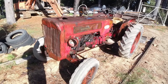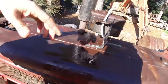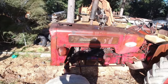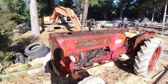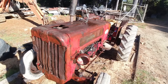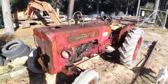Well, it works. It runs on vegetable oil, no problems. It's just about empty. So I was running for about an hour on pure vegetable oil. It actually smells a lot better running on the veg oil, because it just smells like hot cooking oil rather than diesel. So yeah, it's much nicer to operate not having to breathe diesel fumes. It did have a little bit less power on the pure vegetable oil, and it was smoking a little bit more, so it definitely likes diesel better, but it does run on the veggie oil alone.